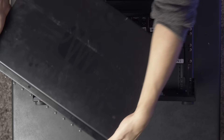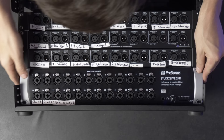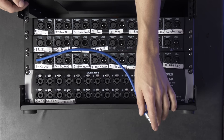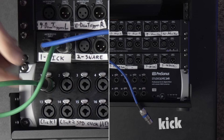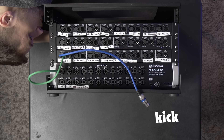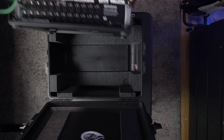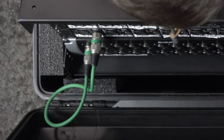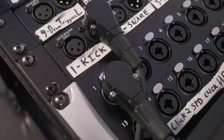The PreSonus 24R has the benefit of having its inputs on the front, which is important because our splitter's passive outputs are also on the front. The idea is: we plug the microphone from, say, the kick drum into its corresponding channel on the splitter, then connect the mic split to our mixer so we can hear the kick drum in our in-ear monitors via another XLR — this XLR also carries the phantom power necessary to power the drum mic. Then we run an XLR from the back of the mic splits to the front of house engineer's stage snake so they can mix audio for the audience. The first problem we ran into was that normal XLR cables run up against the foam of the Pelican case — if an airline worker were to throw the case on its side, the XLR would break off inside the mixer. So we needed right angle XLR cables.